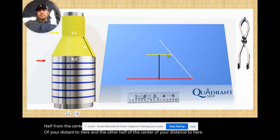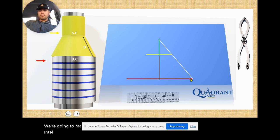Once we have both the distance and the small and big circumference marked, draw a line from one end of your big circumference to the other end of your small circumference, crossing the distance — that's going to be this one line. Once we make that mark, we're going to make another line intersecting both marks, the white mark and the green line right here.